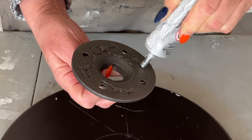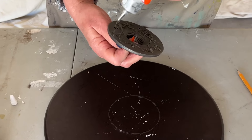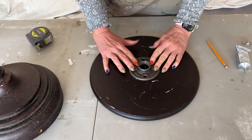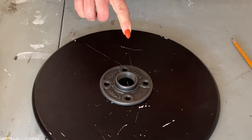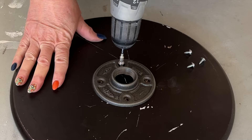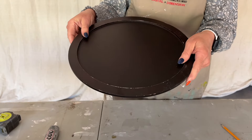I'm not feeling very great today and we're both experiencing reno brain — very tired. I'm going to center the flange on my pencil mark, grab the drill, and pre-drill some small holes. I've got four little screws that should go in about halfway into this tray. We're going to let the glue cure for 24 hours.